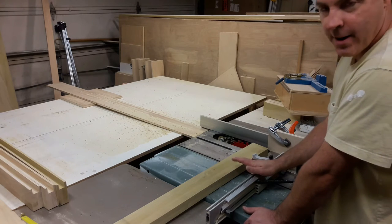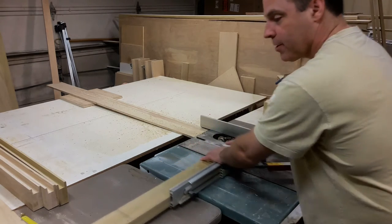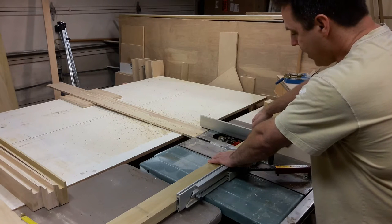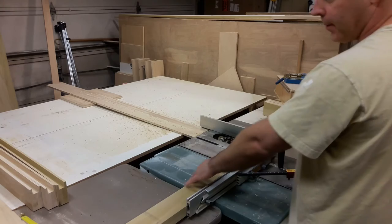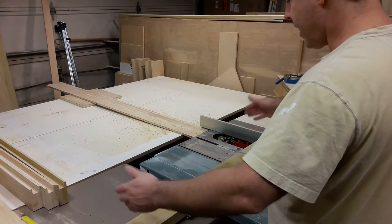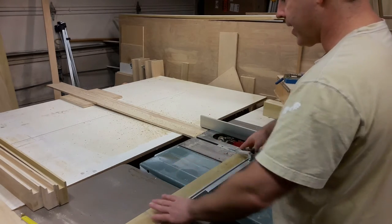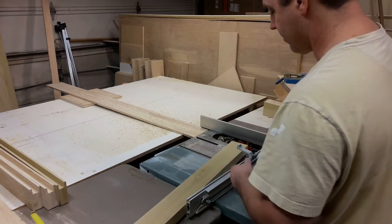I have a guide here — basically just a more fancy miter gauge. A miter gauge that you get with your saw will work just fine. It fits into the miter slot. I hold the tenon against it and put it through the saw. The reason I have this piece of wood here is I'll put it all the way flush with that piece of wood, and as I start to pare down these cheeks and the side channels, it's just going to be free-floating back here. Typically taking end grain, or plywood pieces that are narrower than they are long, tends to have problems if you just put it against the fence — it's going to want to move. And as soon as you introduce movement side to side or on an angle into the saw blade, you're asking for trouble — either kickback or something popping back at you.